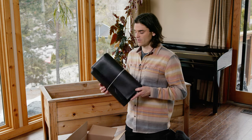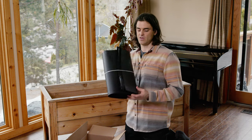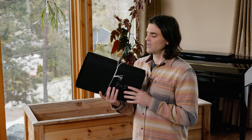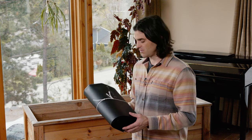In this box I have the two different liner options. The first is our premium RPE 30 mil laminated liner. We can make these liners in a single panel with heat-welded seams — up to about 60,000 square feet in a single piece. Obviously for a planter you wouldn't need that much unless it was a very large planter.